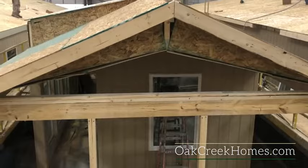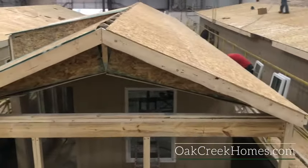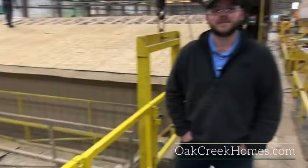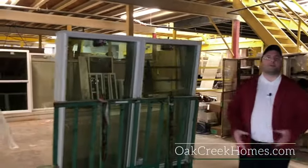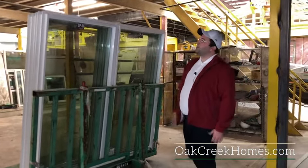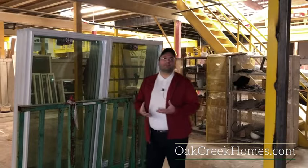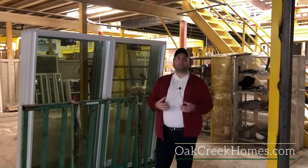You can get a good look at the windows we use — we use low-E windows. When shopping for this type of product, you'll hear 'thermal pane windows' thrown out a lot. Make sure your home has low-E windows, which are used every time here at the Fort Worth factory. These are dual low-E thermal pane windows with argon gas, which gives them that tinted look. That really helps heat or cool stay in — it helps with heat transfer. If it's hot outside, it'll help your house stay cool inside.